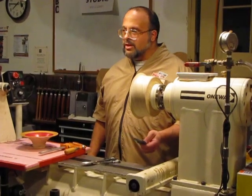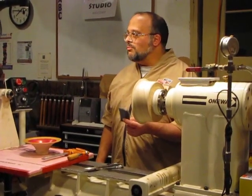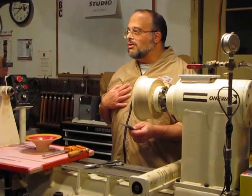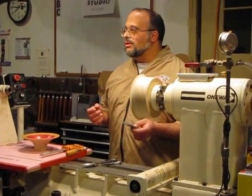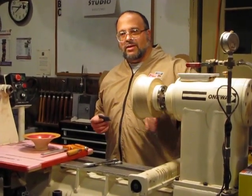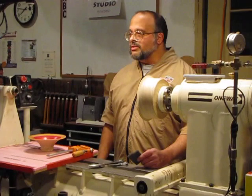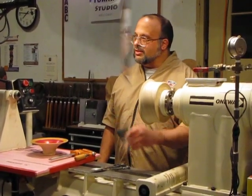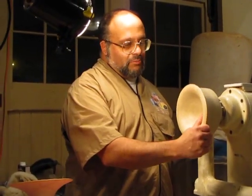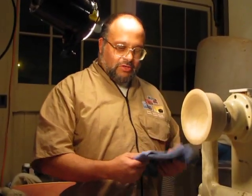It's ultra-fine, I think is what it is these days. They don't really have numbers on synthetic steel wool. Just because this is gray, don't think that it's the right one — you can have gray or brown, and the colors are not universal among companies. It really depends on whether it's silicon carbide or the other type. I gave you the McMaster Carr number for the one I like. On my handout there's a good page on McMaster Carr that explains all the different synthetic steel wool types. The problem I've found with buffing is my chips end up being too big or having sharp edges and they scratch my piece, so I usually use a piece of rag instead.